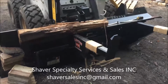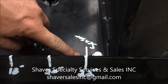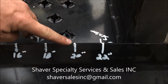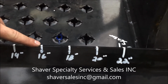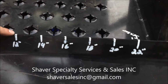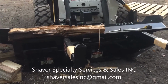All right, just a quick recap. We have the splitter all the way closed. We came over here. We took a mark where the sensor was. The sensor is straight in from here. We marked that at 22 inches because we know that is the maximum cut length. We came back 2 inches because, again, the sensor works backwards. It'll stop in your set increment coming back. So 20, 18, 16. The splitter should come back 6 inches for the 16-inch cut. And then another 2 more. So 8 inches back will give you 14. Another 2 back from that, 10 inches will give you a 12-inch cut. So again, the table goes backwards. The sensor stops it where you tell it to stop based on that little guide bar we showed you before.